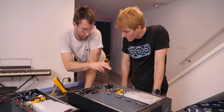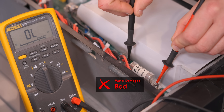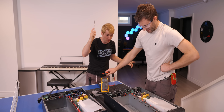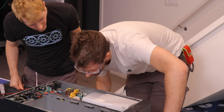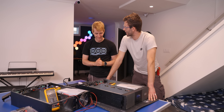It's probably not going to be an easy fix. There's a chance some of the fuses for the inputs blew, or some of the control board back here fried. Could this be as simple as a safety feature working — a fuse blew? Quite possibly. Blown fuses — we know this because we're getting a continuity beep on the shipping-damaged unit and we are not getting a continuity beep on these units. This is input from the batteries to the inverter. We should probably take these out of the chassis.